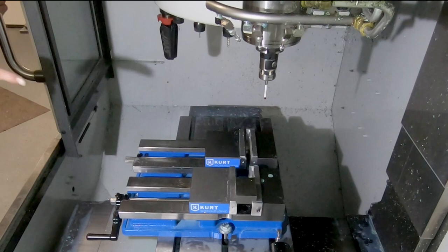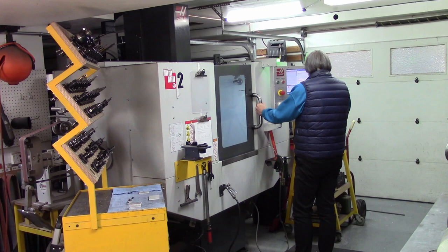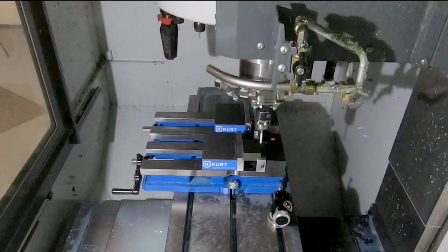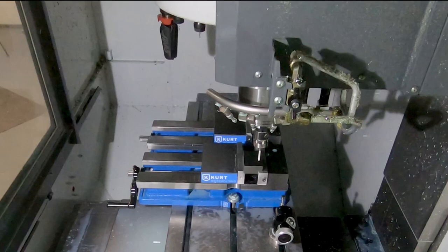So I'm also going to be using another work offset. I use lots of work offsets in the shop. I'm also going to be using a right-hand work offset, and you'll be able to see why I'm doing that in a moment, but I don't have a combo probing routine set up. So I have to go over to the interface and select it, rapid down to a safe height, protected move, measurement. The LEDs that are flashing are indicators telling that, yes, the battery is okay, yes, the surface has been found, yes, the probe is happy.